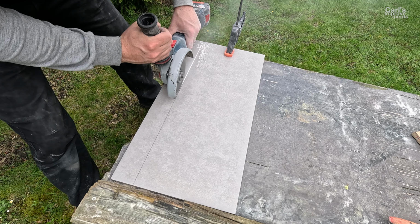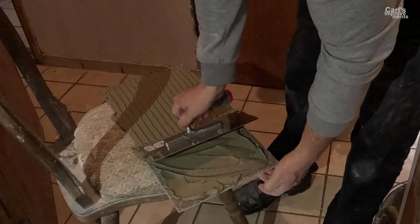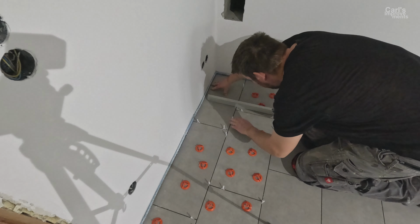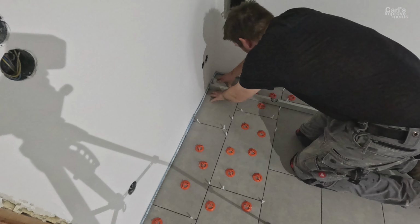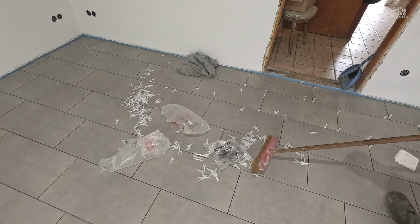The last tile is cut. And it fits. Our last row is a nice width, and it is hardly noticeable that we have cut off a few centimeters here. So all the calculations at the beginning were worth it. After the tile cement has hardened nicely, the threaded caps are unscrewed and the threaded tabs broken off. They are made the way that they break off at the bottom.